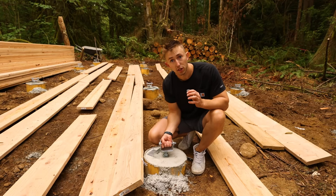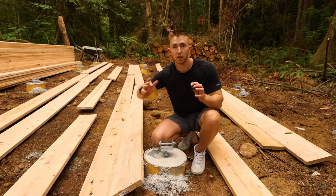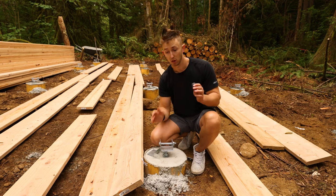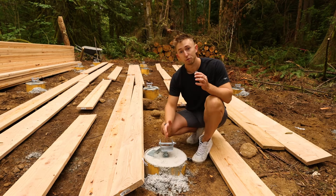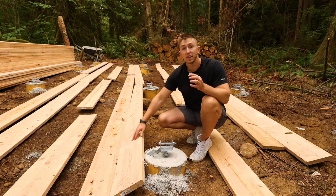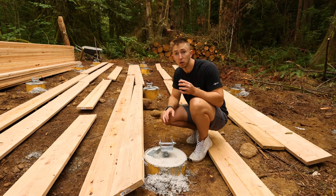These concrete supports don't have tons of lateral bracing, so say like a wind's hitting the home, they're not the best for that. We're going to have to be doing 4x4 kickers off of these 4x4 posts that stand up and hold up the beams. We're gonna take a 4x4 treated post, stand it up vertical, and then sister up these 2x10s and run beams the entire length of all this on top of the posts.